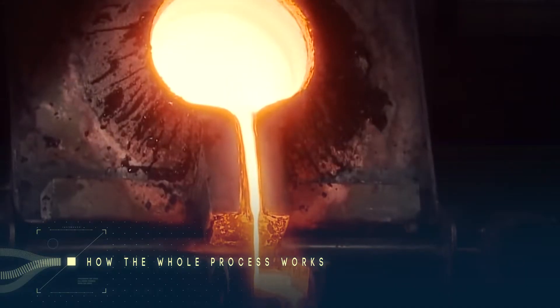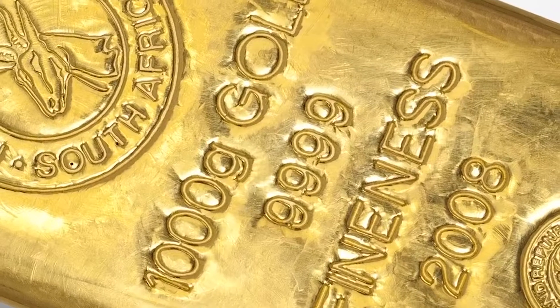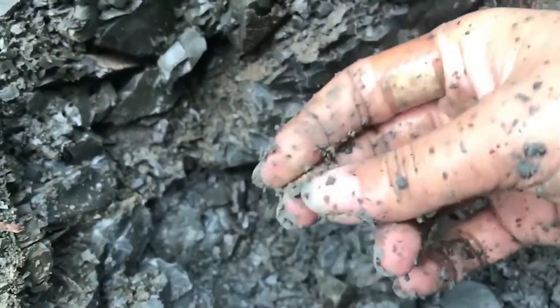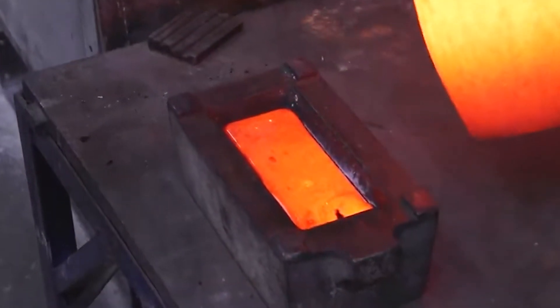Manufacturing pure gold bars is not an easy process — that's because it's so hard to purify. When you find raw gold in nature, it's always mixed in with other substances. It takes a lot of energy and time to separate gold from the other types of metal it likes to join up with. The process starts with mining — taking the gold in its raw form from the earth — then you extract it, smelt it, and refine it to produce pure gold. At every stage of the process, you need to stop and test that your gold is as pure as possible.